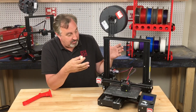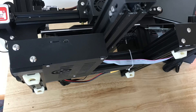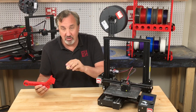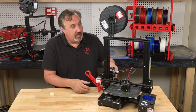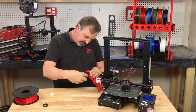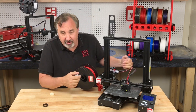This is an older Ender-3 Pro in my shop — I've modified it with an EZR extruder so I can print flexibles, and I printed flexible feet for it that lift it higher than a normal Ender-3 Pro would be. That's why I put that taller knob on mine, because most of my machines have these rubber feet. So now I can just slide this on, take the existing spool holder, untwist it, and slide it into my new mount, twist it, lock it in place — and I have a side spool holder for the Ender-3 Pro.